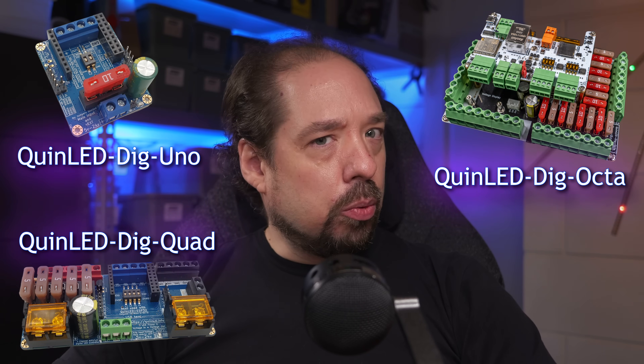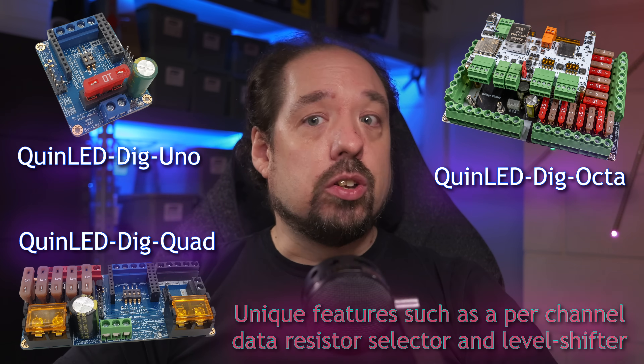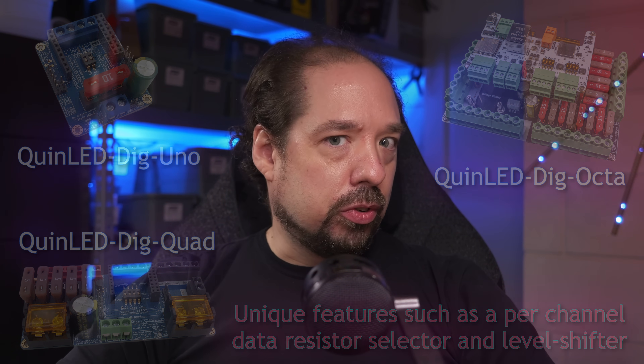For as long as we've all been playing with addressable LEDs, the distance these LEDs were from your controller — be that an ESP32 or QuinLED Dig controller — has always been a much-discussed topic. While the QuinLED Dig boards have special circuits to try to get the data signal to go as far as possible, generally we still don't advise making your data lines too long. In practice, 5 meters or 16 feet has always worked fine, and up to 10 meters or 32 feet has mostly worked okay. Beyond that, it's been everyone's guess, partly because we are stretching the type of signaling used well beyond its designed limits.